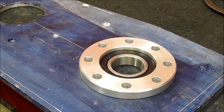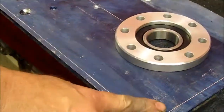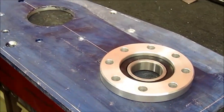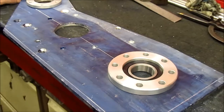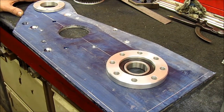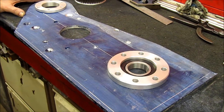One more step done on the road to our space bike being completed. We've just got to mill the plate to the lines — that's why the blue ink's on it. That blue ink is just like a dye: you paint it on with a brush, then you can scribe marks on it. Identification ink — it's great for working with, you can see lines much more clearly.